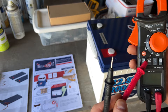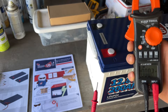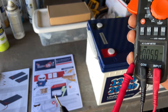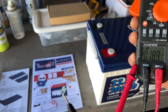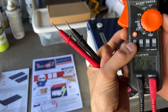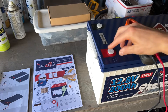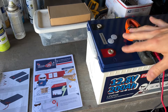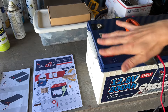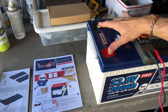Most voltmeters have a similar design: a dial in the middle with settings around the outside. We're looking for voltage, so we'll move the arrow down to the V which stands for volts. In the corner it says DC - direct current - which is what we want for testing batteries and solar voltage. If you were testing home electricity at 120 volts, you'd want AC, but for this test we're doing DC. Then we'll pull off the battery terminal caps - those are just shipping safety devices to prevent the terminals from touching during transit. Word of warning: never let anything touch both the positive and negative terminals at the same time.